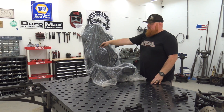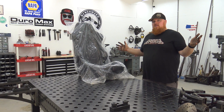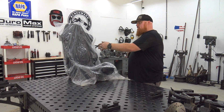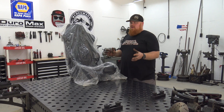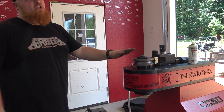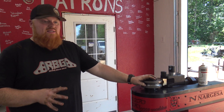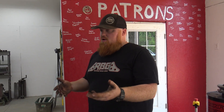The first thing I'm going to do is make two 90-degree bends in a piece of tube that'll start the back of my floor pan. I get my tube cut in 10-foot sections — they're 20-foot long when you buy them. I'll mark a center line and show you how I measure for where my bends need to start. It's handy to have baseline bends on the shelf — two 90s and two 45s — because you can lay those out on the weld table and figure out if that bend is going to work for you.